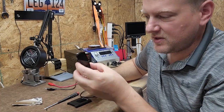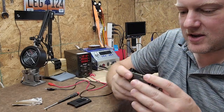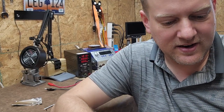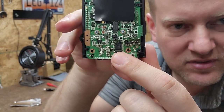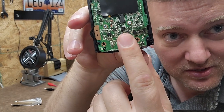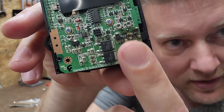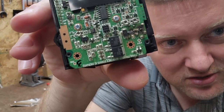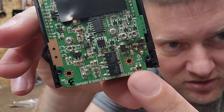I have to be very careful because this is obviously a lens for the detector. But I can smell it — the burnt electronic smell is a fantastic and definite sign. What I want you to see is right here: this discoloration. Anytime you see chips like these, it's probably going to be a regulator for your DC rails. Burnt, burnt — still very fixable, definitely fixable. I'll have to research what those parts are and maybe change out some others, because those look like they are part of the voltage regulation.